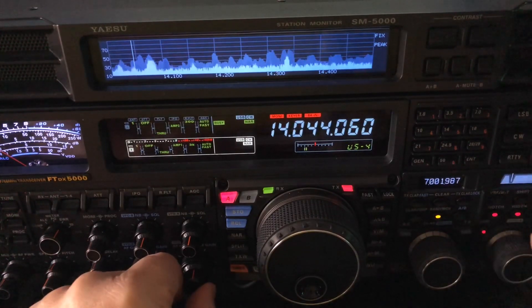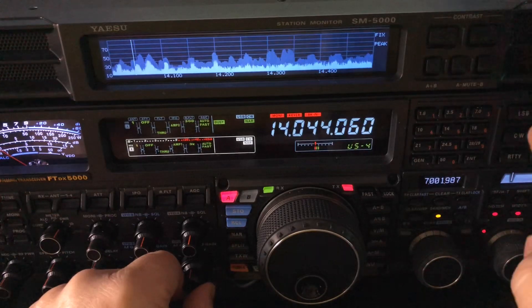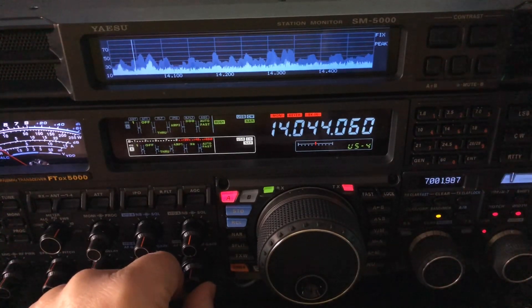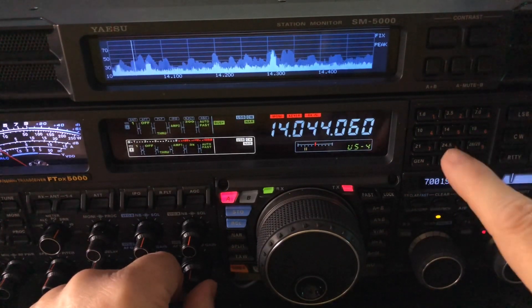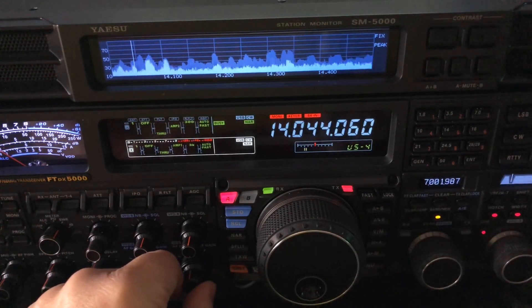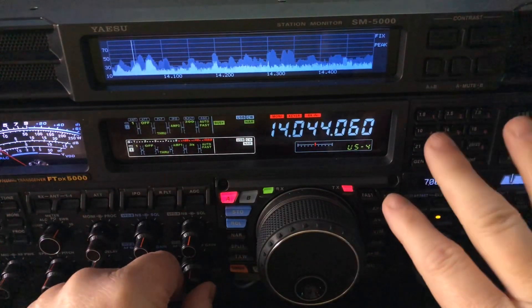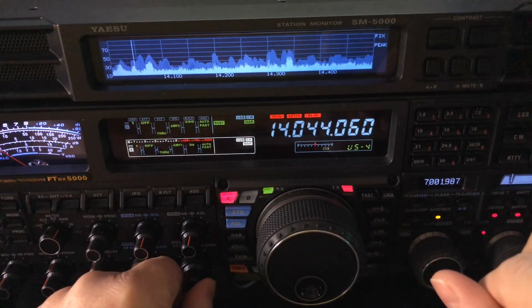So just wanted to give you another tool in your arsenal. Any radio can do this. Use your CWL or CWU option to get that offending side tone to be low pitched. If somebody is 100 hertz away, you'll have no trouble at all knocking that out. I've shown that in a video comparing this radio to the FTDX-10 for fighting QRM.